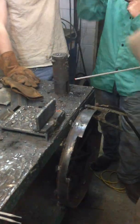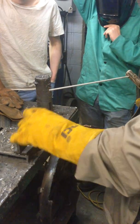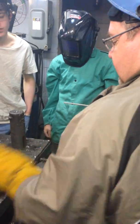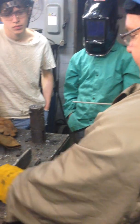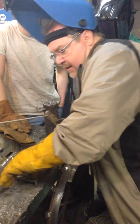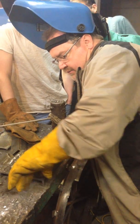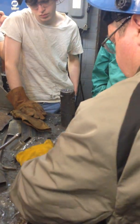Now, if you tack it on the end — tack it right here on the end — that doesn't really give it a place to pull from, so it won't pull to the side. It's going to try to maybe pull this way, but it won't be able to, and you've got a little bit of control. You can actually bend that tack and get that plate in line. Look down the top of it and see if it's at a 90 degree angle. This one looks pretty close, so I'm going to go ahead and tack it on this end.